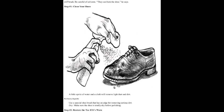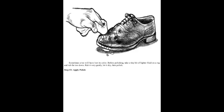Degree of difficulty, medium. Tools needed: bucket, cleaning solution, brush and/or sponge or rag, spray bottle, newspapers, squeegee, ladder(s). The game plan. Windows should be done on the inside and outside. Start with the latter. If you run out of steam halfway through the project, you'll feel better if it's the more difficult outside part of the job that is finished first.